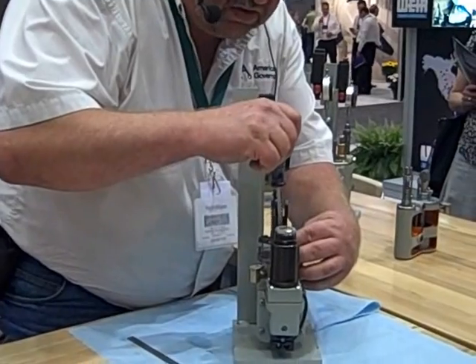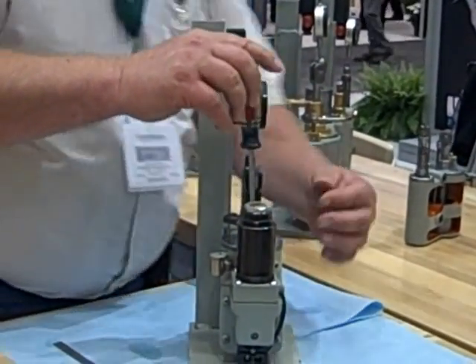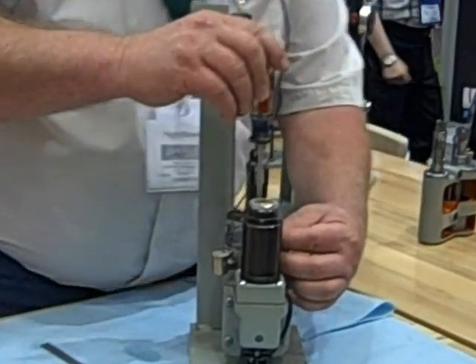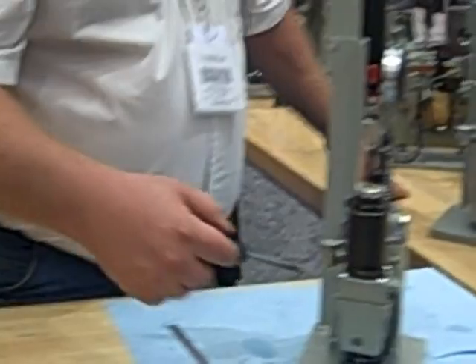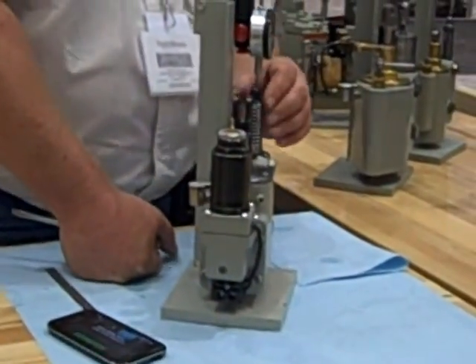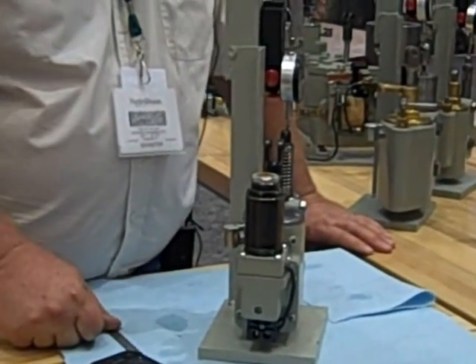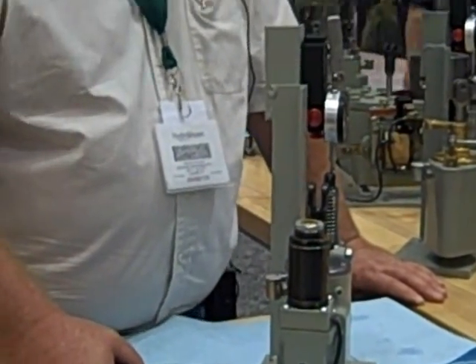If you've got your needle valve closed all the way and your unit still isn't stable, your dashpot may not be very good — meaning there's internal leakage. So this is the test that was developed. I was actually involved in the development of this test at Woodward when I was working there. It's called a Dashpot Reset Time Test.